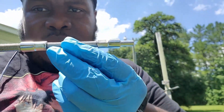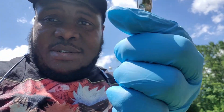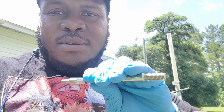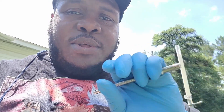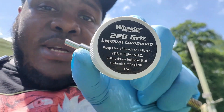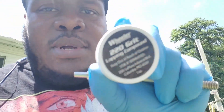Another piece you get with the Wheeler kit is a threaded flex drive. This goes into your drill, but it flexes for those of us who can't seem to hold even pressure — it keeps you from putting too much pressure downward or upward on any particular surface of the upper receiver, helping you keep it even for a flat cut all the way through. And of course you get the lapping compound — this is 220 grit, because we want to cut a little bit of material away to get that squared, true flat surface.